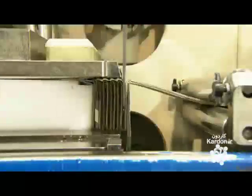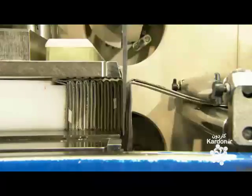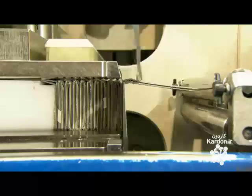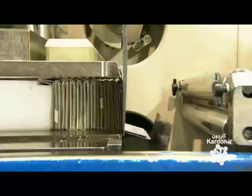Each heating strip goes into a machine which repeatedly folds it up, then down, pleating it like an accordion. The thick steel fibers are what trap the soot particles as the engine exhaust flows through. An electrical current heats these conductive fibers, burning off the soot regardless of engine exhaust temperatures.